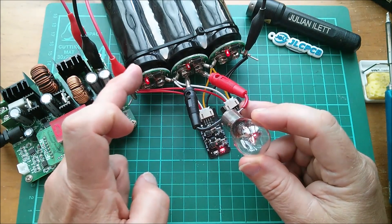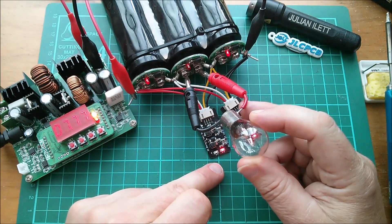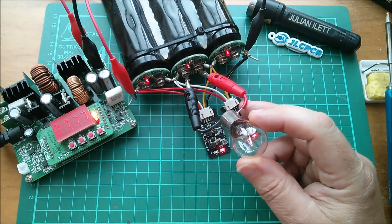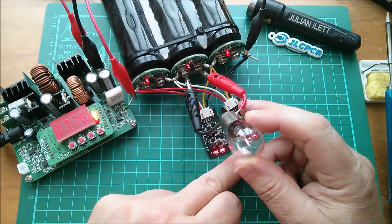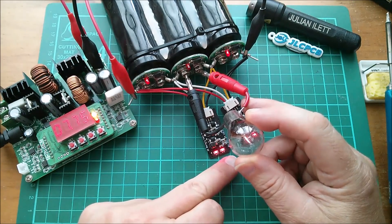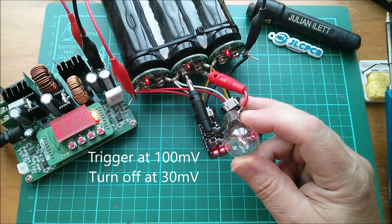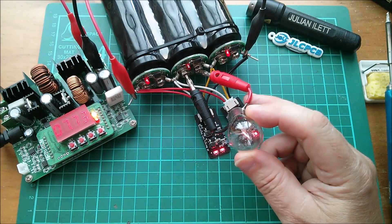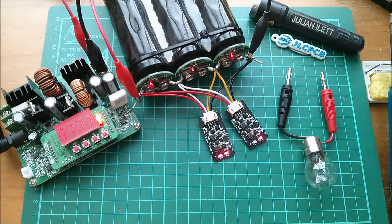When the left-hand cap comes up to full voltage it should put both lights on, transferring current or charge from both outer caps to the inner cap under heavy discharge from this 12-volt brake light bulb. We've got both lights on on this one — not the other yet, but I'm hoping that will happen. I thought these things were meant to trigger at something quite small like 30 millivolts of difference between cells, and there must be far more than 30 millivolts difference with this whopping great load on there.